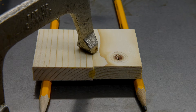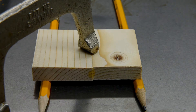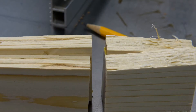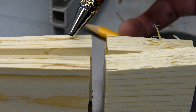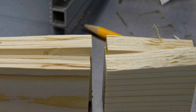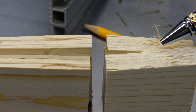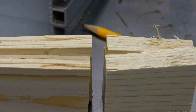This is the piece with the cheap carpenter's glue, and I'm going to make a prediction — I think it's going to show the same results. These two pieces are from the cheap carpenter's glue and these two are the Titebond III. You can clearly see that in both cases wood from one piece is on the other piece, and this one here didn't even break anywhere near the joint. Bottom line: the joint held and the wood let go, which is sort of what I expected.